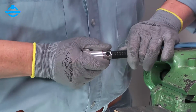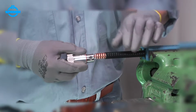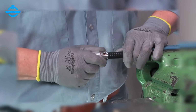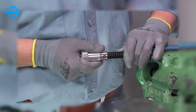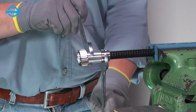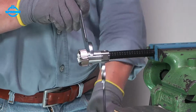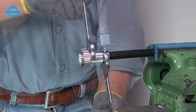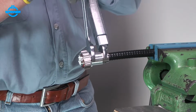Push the entire connector with a slight rotation onto the cable until a click confirms that the connector has snapped over the outer conductor. Now, pull the connector to lock it with the corrugation. Tighten the back nut and the connector body using open-end spanners. Make sure to hold the body and rotate the back nut only. Torque the back nut to the value given in the installation instructions.